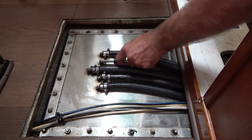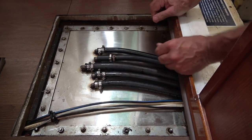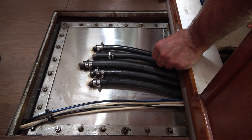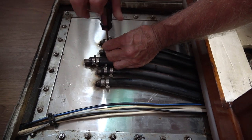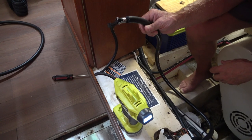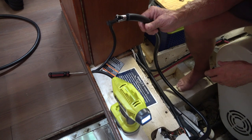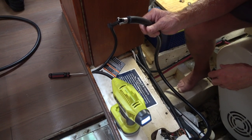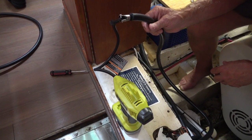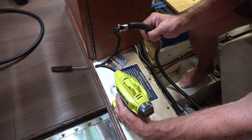Here's the new line — just tighten down the hose clamps. The hose was clear when the old fuel hose came off, which means something is clogged. There are two long metal stainless tubes going down to the bottom and something was clogged in it, so I'm going to unclog it and push some air in through the diesel line.